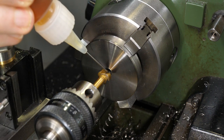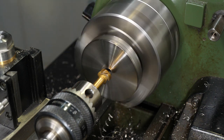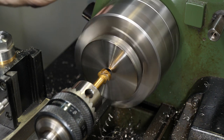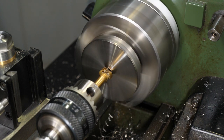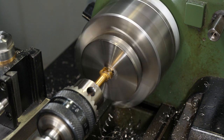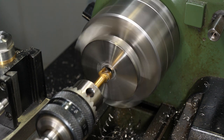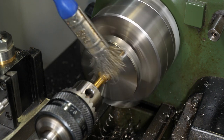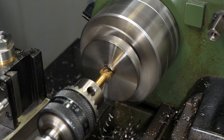I planned to use a countersunk head screw to attach the hook, so I drilled a countersink into the back of the plate so the head was completely hidden. Drilling this involved a lot of engagement between the cutter and the part, so I took it fairly cautiously, taking particular care to try and prevent too much rubbing.